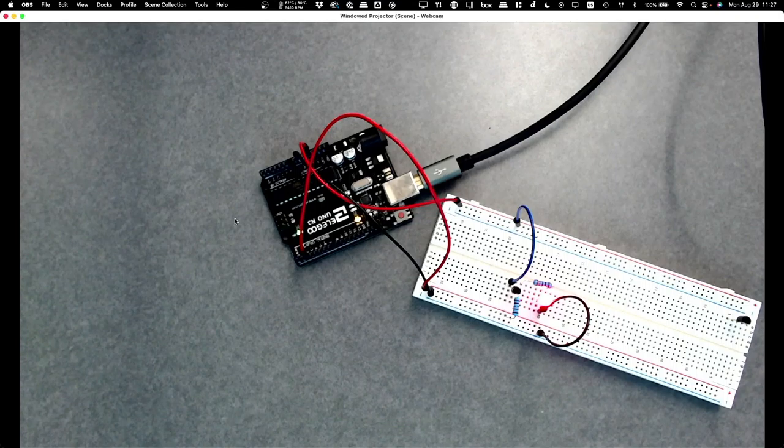All right, then you've got a bunch of resistors. Those are labeled. So there's 220, 1K, 10K, 330. And then the transistors are labeled BJTN because these are NPNs and they're BJTs. Okay, then you've got a little bag of breadboard wire. And so just go ahead and open that up.